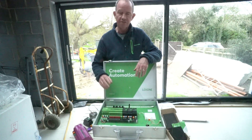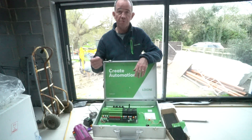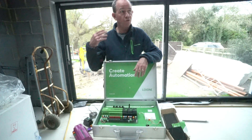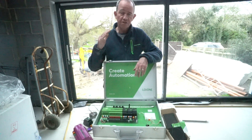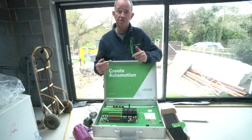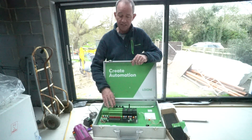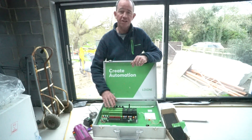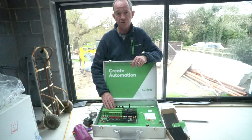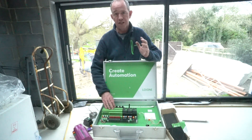For blinds, the technology we plan to use is a combination of Velux roof lights — we've got four in the open plan room and another in the hall — which are both electrically openable and have electric shades. We'll also have Somfy RTS, which is a wireless protocol with connected motors. Another gateway called the Somfy Tahoma has an open API, so we'll be able to create virtual devices and control the blinds and windows from within the Loxone system.